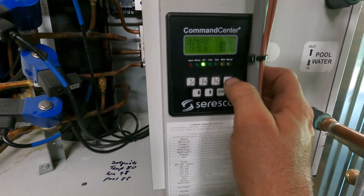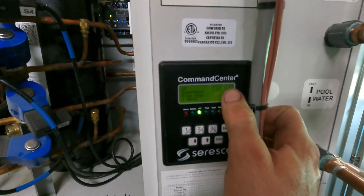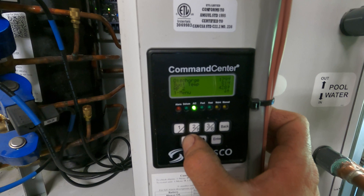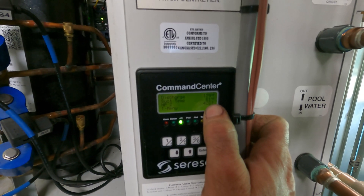Low pressure on unit one is low, and the charge is 179 — it needs gas to cool it off. But head pressure on unit two is 430.